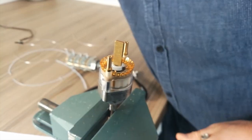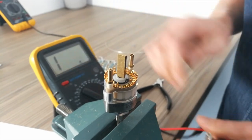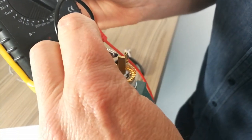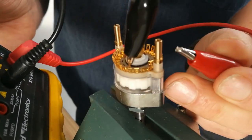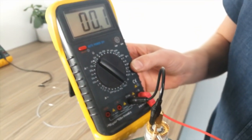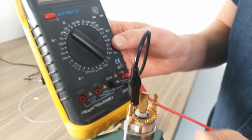So with a meter, just to show you, that tag connects to there, your output tag is there. So I know that the resistance when I touch there is going to be zero because that's the first. And there we go. So there's your connection. Position two. Position